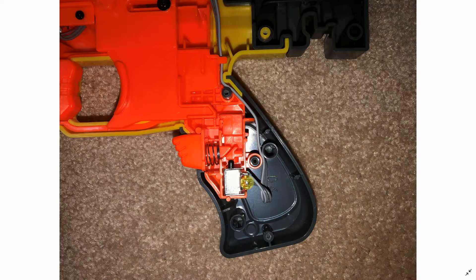This circuit is normally open, so sending a high pulse closes the circuit and powers the spin wheels. Sending a low pulse reopens the circuit and removes power, turning off the spin wheels. Let's see this in action.